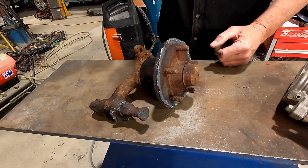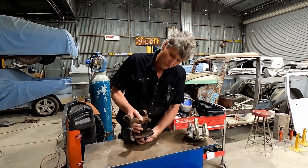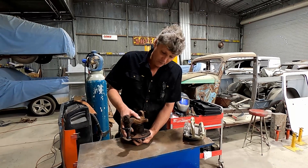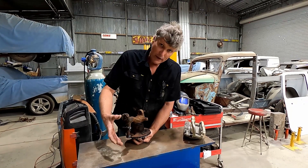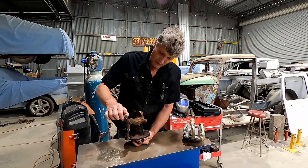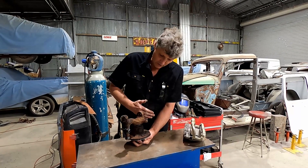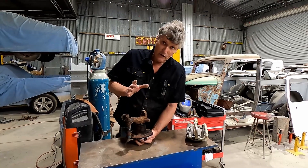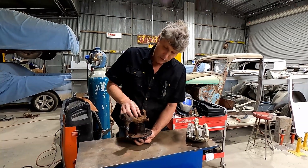From this piece I'll be building a jig to hold it all in alignment. I'll drill a plate so I can drop this in — I don't need all the studs, so I can just put two or three in and bolt it down. Then I can make a couple of brackets with the tapers on here for the ball joints to make sure I've got the alignment right.